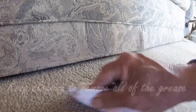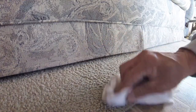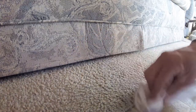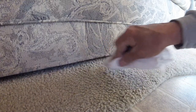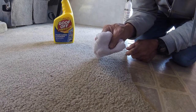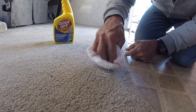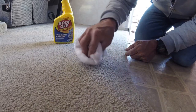Use light to medium pressure — I wouldn't even say medium, just light pressure. Work the nap in a couple of different directions. You don't want to force the stain down into the fiber any more than it already is. The key with this is don't rush it. We're looking for excellent results and it just takes time.